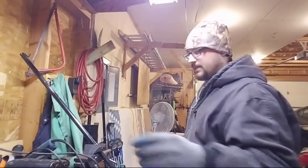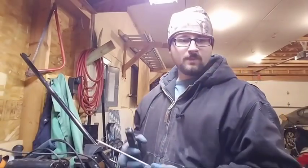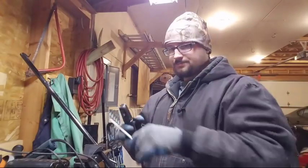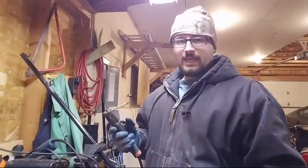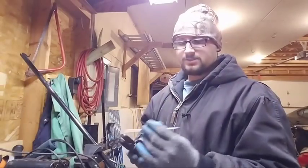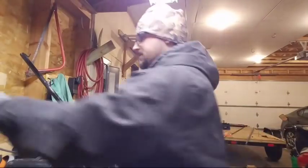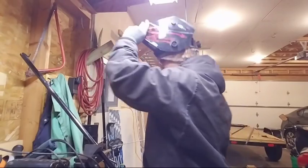So today for this, actually I got one sitting here. This is a 6011 rod. It's kind of my go-to. I also have 7018 AC, but the 6011 burns hotter, and if you're tacking something, you want that power right there. So it works very well. This one's actually a little crusty. The end's poking up. It's garbage. So let's grab a full length one. All right, so there's that. We're gonna just pop on our helmet and we'll get to welding.